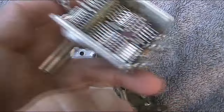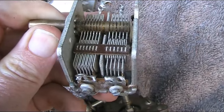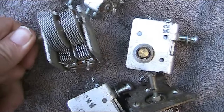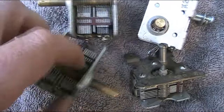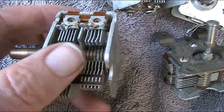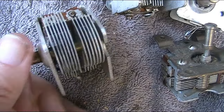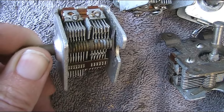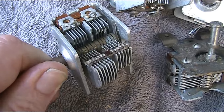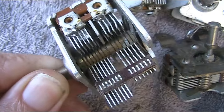When you buy these capacitors, have a look at them carefully. Make sure that their rotation is smooth, or you might even want to carry along to the sale a little multimeter, just to make sure that the plates aren't shorted or there are other problems. If you look at this one in particular, you'll see that some of the plates are bent — this is not going to be a very good variable capacitor. In a quiet room you'll hear the plates touching. This capacitor's rear gang does need a bit of work if it's going to be made useful.